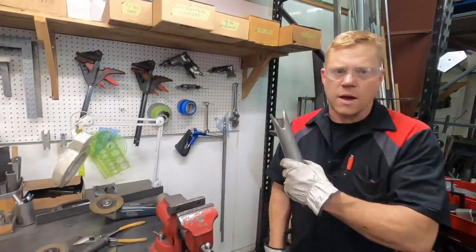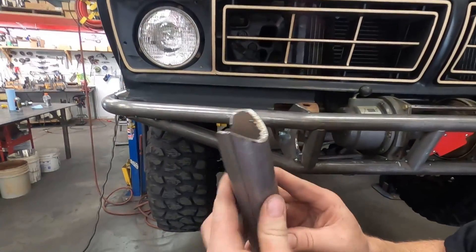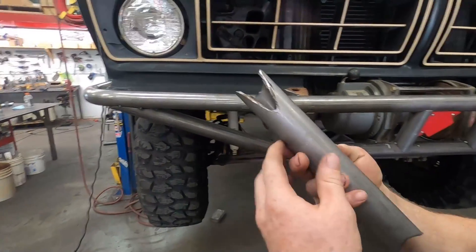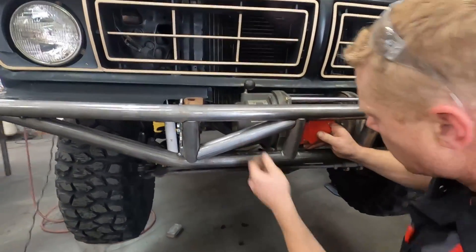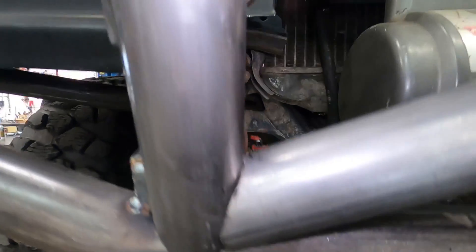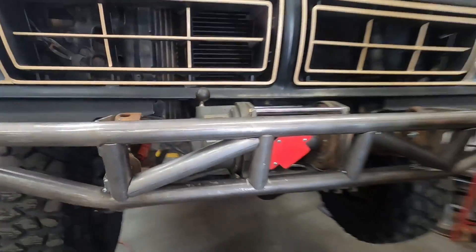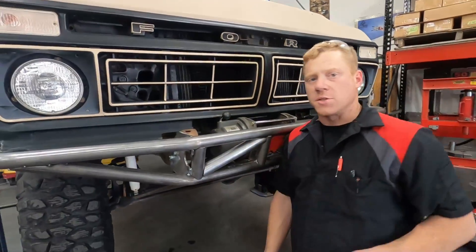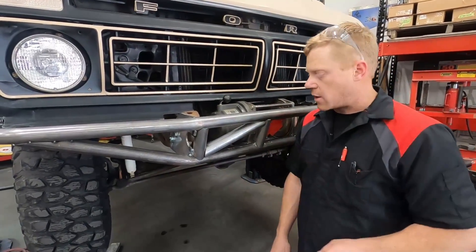Okay, now I'll go do another fit. Did a little dusting on this guy and kind of sanded those spots up. Didn't take a whole lot of sanding, and now she's fitting good — nice tight cope there. You could easily TIG weld that, and that was only a couple minutes of grinding, which is definitely necessary when you're doing things like this.